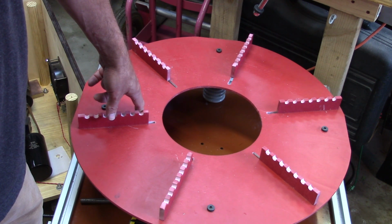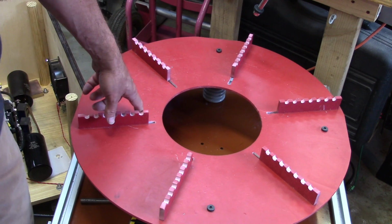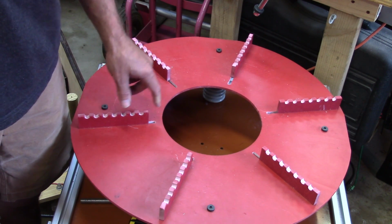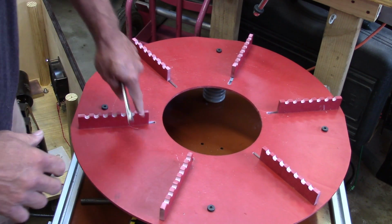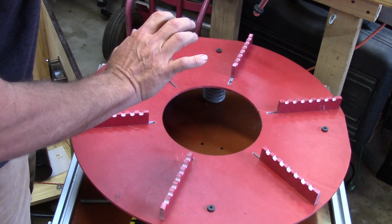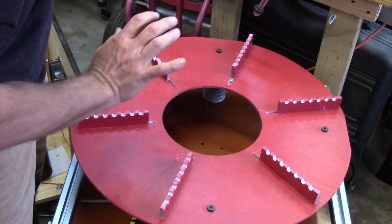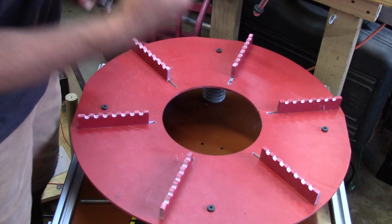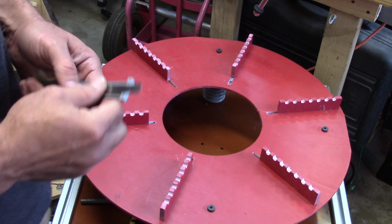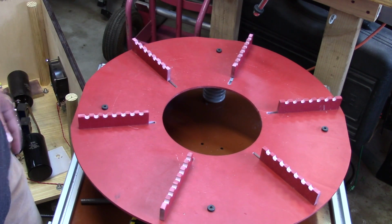Yes, there'll be a different spin or a different orientation of the magnetic field that's created. You remember the right-hand rule, or if you don't, you can look it up. If the current is flowing this way in a solenoid, the magnetic field will tend to point downward. If it's spinning the other way, it'll tend to point upward. It does not matter. The phase will be 180 degrees off. Really doesn't matter when you're building a Tesla coil.